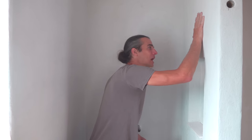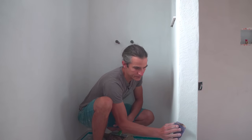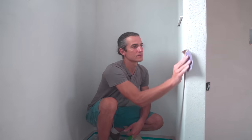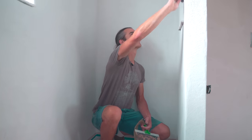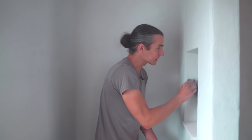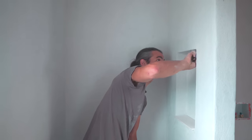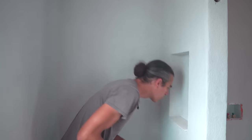What's so beautiful about lime, well, there are lots of things. Not only does it create that effect and that feeling, but it also creates a wall system with an incredibly high pH level. It's super basic, a pH of 10 to 12, so no mold grows on this stuff. There are specific care tips, though. You can't use any acidic cleaners on it. For us, we're actually doing travertine tile, which is a limestone-style tile, so the whole place is good. You don't have to care for it the same way. The maintenance is a whole different thing. If you start putting weird cleaner products on this, it's not good for the plaster. But otherwise, it's easy to clean and keep clean.